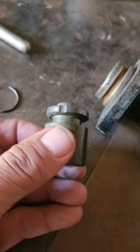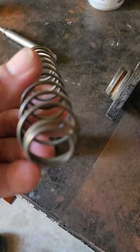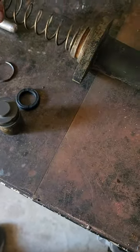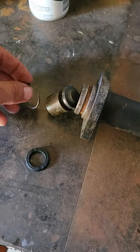It's pretty obvious that was the cause. The spring has a small end to a large end — the small end sits on top, which then goes in with your o-ring on it, and then your split ring goes in to lock it all into place. Using my mobile phone I'll show you how to put it all together and talk you through it. Very basic job — I couldn't believe it. I'll show you with the old parts and then the new parts after I've done the job.